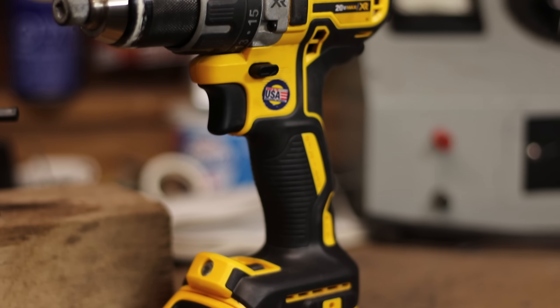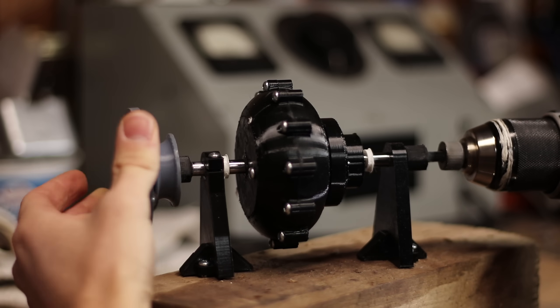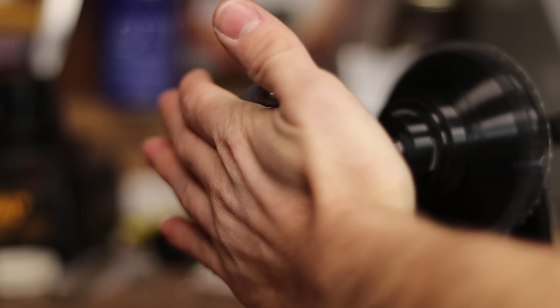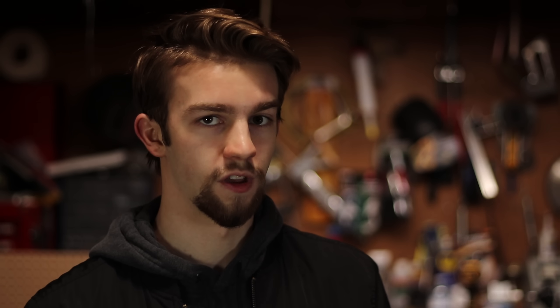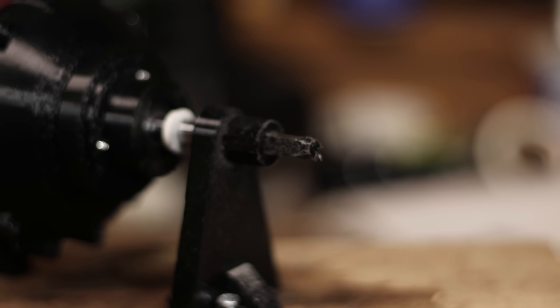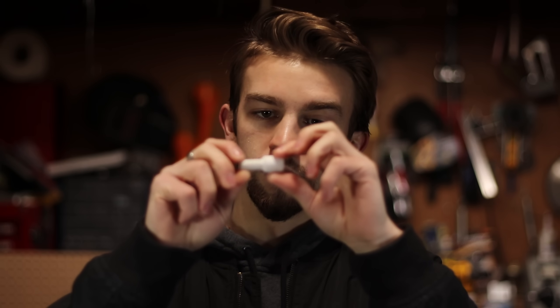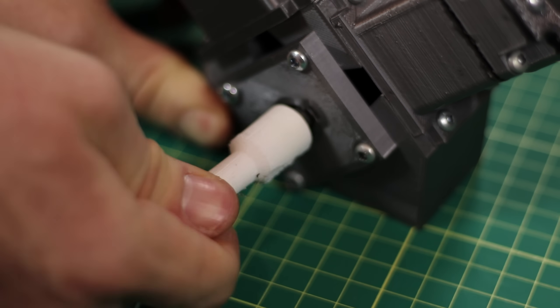To fix this problem, I'm going to try a different power drill that spins a lot faster. This new drill worked so well that the other side was able to lock up enough that it rounded off the end. My solution was to make flexible TPU couplings. Not only is the TPU going to absorb all of the vibrations, it's also going to prevent any damage to the shaft. If anything were to happen, it would round out the inner part of the coupling since it's flexible, and it would protect the outer shafts of the fluid coupler.